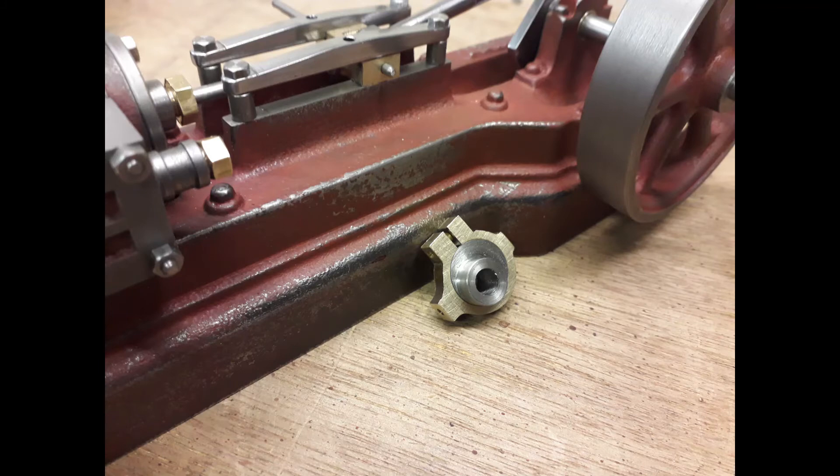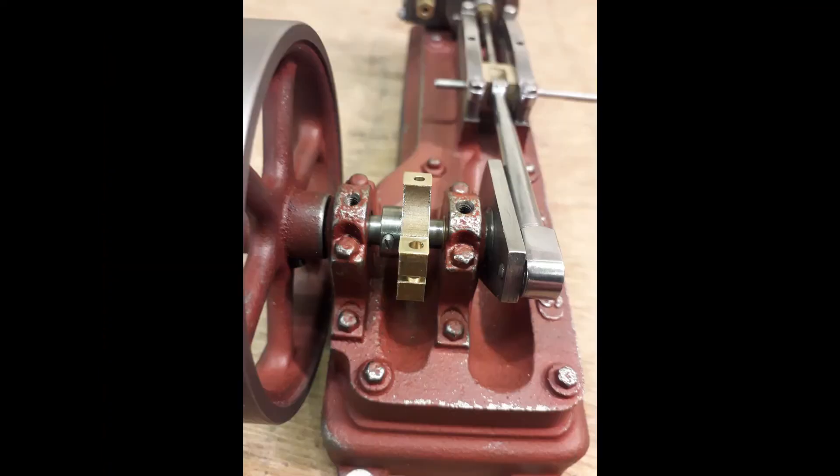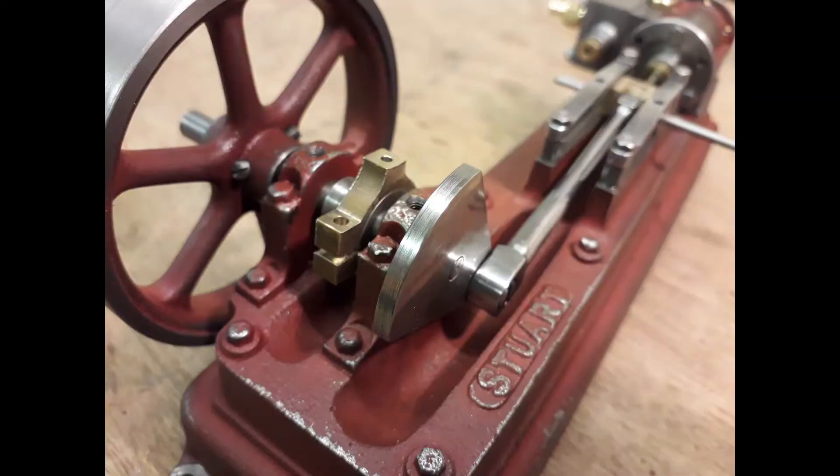So there it is. What we did there - you can see we just put the slitting saw in and put the slit in there, tapped the bottom as you can see on the picture. So that's really just the clamp on. We also drilled the little grub screw that you can see there. Job done. Like I said, a little bit of footage missing there, but I think it's quite explained how we did it - just using the slitting saw. You can even just use a hand saw in the vise if you want, it's only just to open that up to give us that bit of movement for clamping.